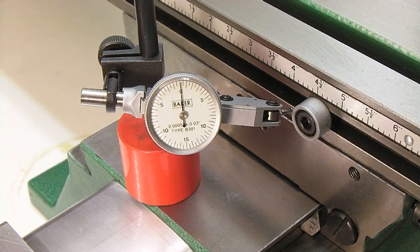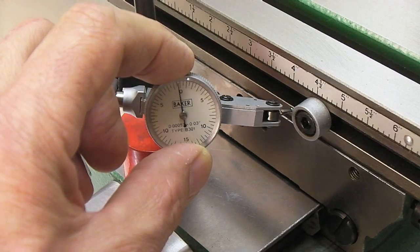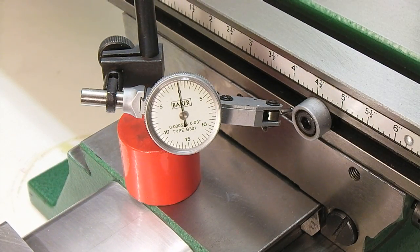We're going to move forward. The needle is moving and we have half a thou registering on the DRO. Let's move forward again, move back and try to get it a little more accurate. It's on zero. We'll zero the DRO. The needle's moving at six, and the DRO now says one thousandths, and the indicator is basically saying half a thousandths. So we've got half a thousandths backlash in this one.